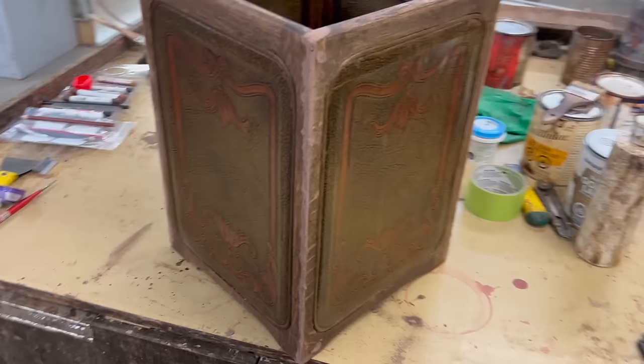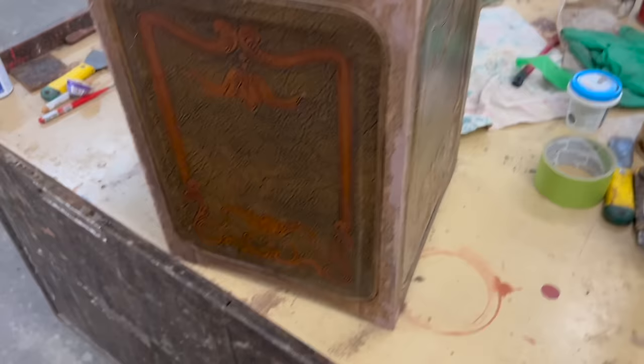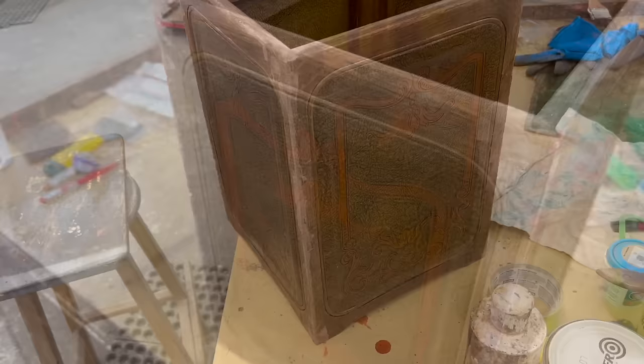So I've got some putty here. Our miters came together really well, but we have some chips and things along the sides where we didn't repair, and blending in our repairs as well. You can see a lot of little pieces of wood that we've stuck on there, and a few nail holes that were there from before when it was being held together with nails. So that's pretty dry right now. So I'm just gonna go, I don't wanna get rid of all the little dents and scratches on this whole thing, but gaps and big gouges and nail holes, yes.